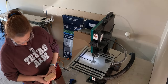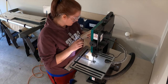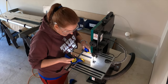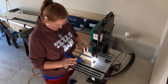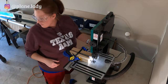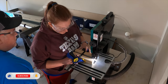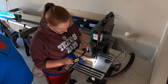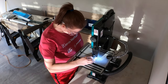On to 9-15 step eight, where we're trimming the counterweights. Looking at figure three, the shaded areas show what to trim. On the diagram on the right, you remove the raised shaded portion from only two weights — it's a very narrow piece you're trimming off an already narrow side of that counterweight. I did not want to hold that by hand with my fingers close to the blade, so I got out some scrap wood and a clamp and used that to guide the counterweight through. This turned out to be a great idea for another reason: the counterweight was really hot when I touched it afterward, so even if you weren't afraid of the blade, it will get really hot during this cut.